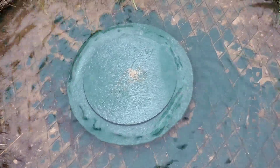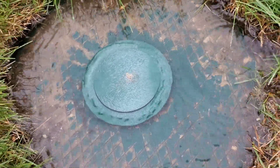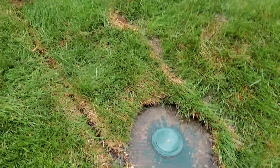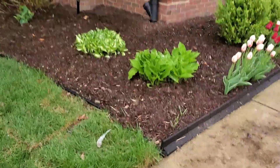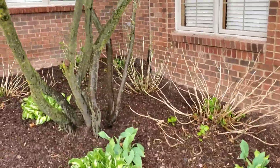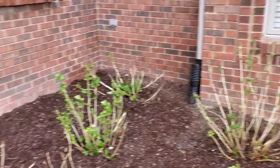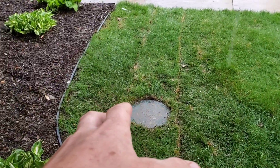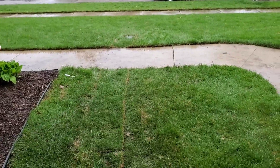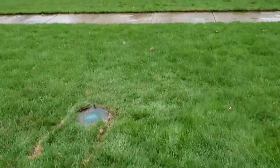The water just trails off into the grass. We got it plenty far away from the house — a beautiful example of how our turf restrictor plates work here. We've got a downspout there, a downspout here, a downspout here. We ran them all to the same D-box and took it out to our pop-up emitter with our turf restrictor plate.